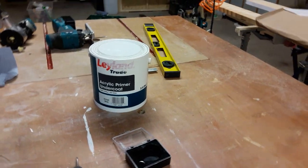This one has been painted with the primer and undercoat and has dried — you can see it looks really knobbly. And then this one has been sanded after the paint has dried, and you can see the difference: it looks nice and smooth. That's the finish you want to get on it before you paint. I hope that's of some use — comment below with any questions. Leyland Trade primer and undercoat — absolutely brilliant. Thanks for watching.